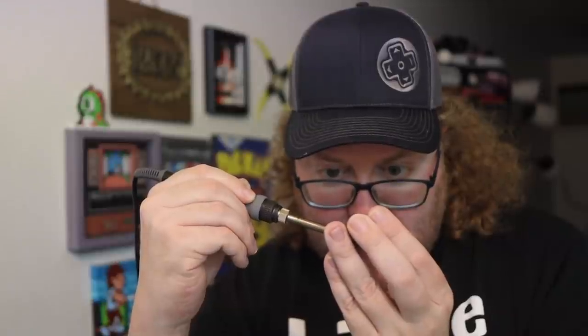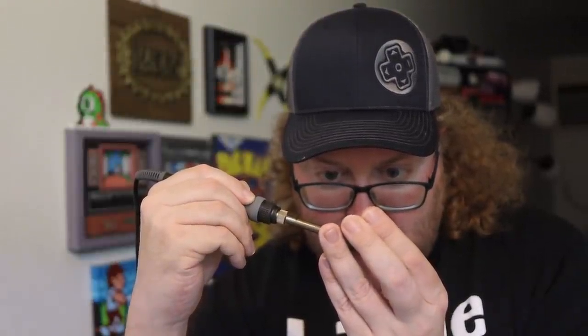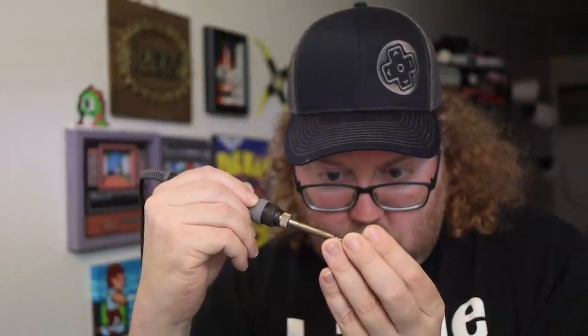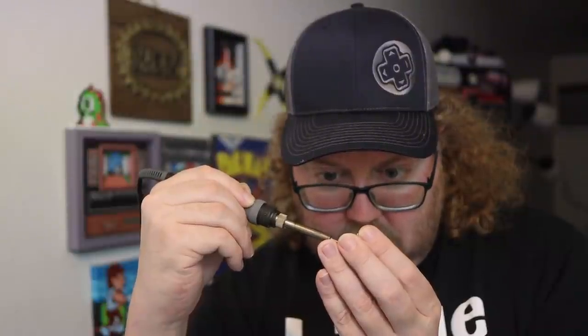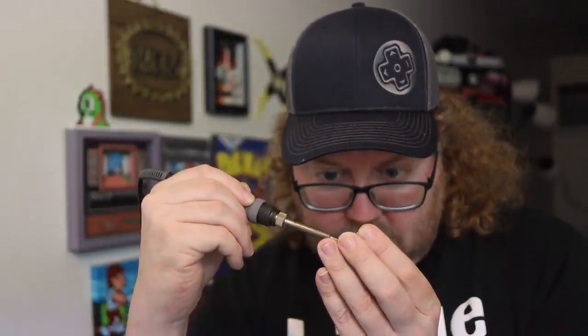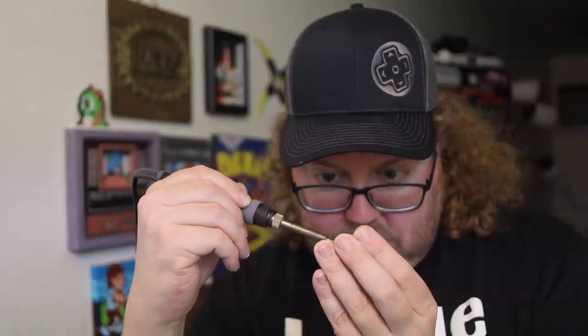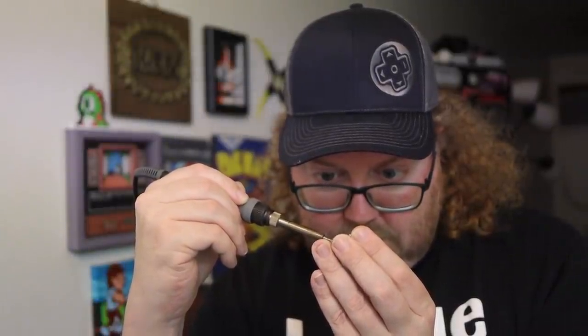You've tried cleaning them, you've tried the 1-Up card, you've tried rubbing alcohol and Q-tips. Did that for years. You can definitely tell when they're melted too, because the pin wants to wiggle a little bit. But you need that solder there so the pin can tell the rest of the board where to go, as far as the information goes, from that specific pin to that part of the board, whether it goes to the NES or the MMC chip or whatever it is.